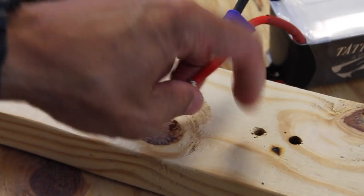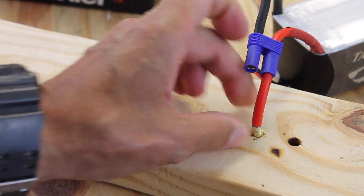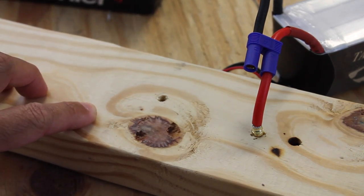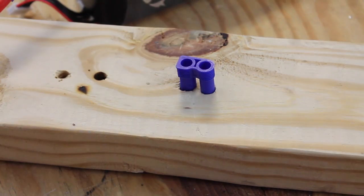The first thing I like to do is drill a little hole in a piece of 2x4 and put my gold connector in there. It's nice and snug and easier to solder — gets that cable down and secure. You can even put the EC5 connector housing in place so you can just slide your connectors right in.